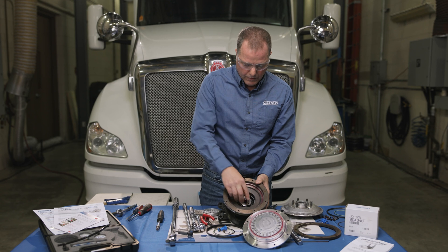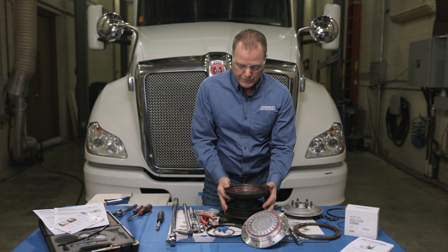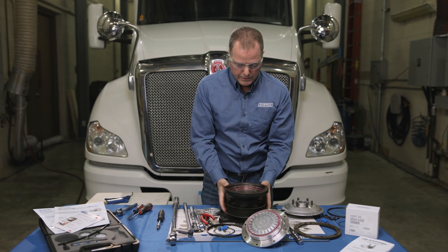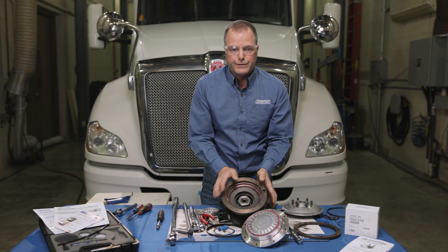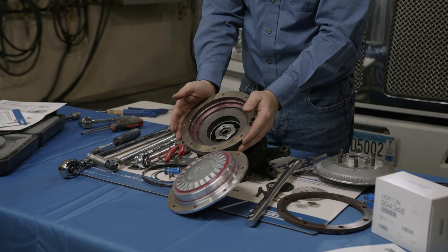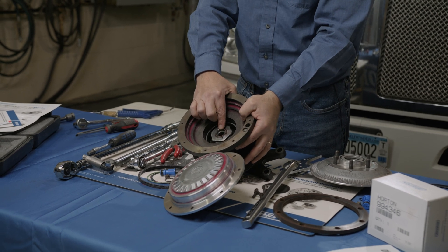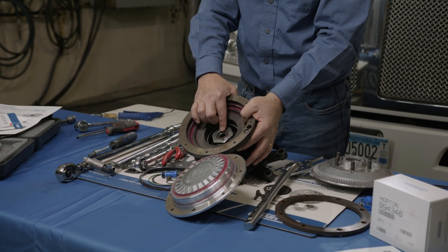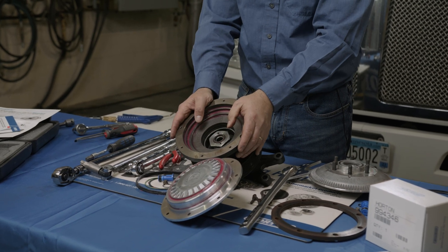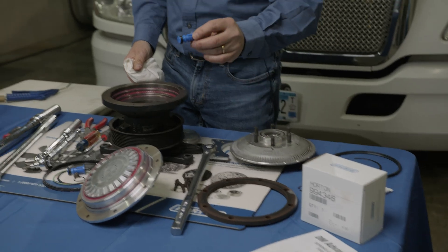At this point you can see the main nut holding the back bearing in. I always like to check the bearing to make sure it feels good. Our drag bearings are designed to go the distance, so we're keeping the main nut intact. Also check the air passages — make sure there's no dirt, moisture, or rust. If there is, clean it out with a wire brush and blow it out before reassembling.